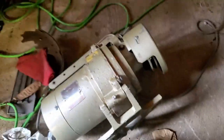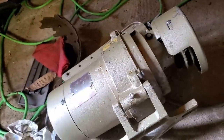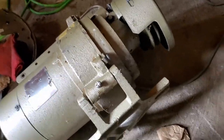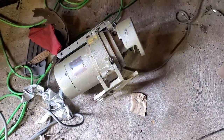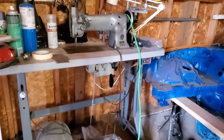I mean, it's pretty old school, bulky, and uses a ton of power even if you're not stitching with it at the time. So that's why I'm getting away from these, because the electric servos are far smaller, and you can have it clicked on, but if you're not stitching with it, if you don't have your foot on the pedal, you're not using any power. This, as soon as you click it on, it's moving and it's going, and it's not going to stop. That little bitty servo underneath there, that little bitty motor, is what replaces this big hunk thing. So, easier to move the whole machine around, easier to operate, smoother to operate, and just makes your life a whole lot easier. And that's one of the things I really want to focus on and talk about, okay?